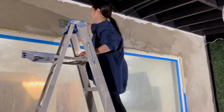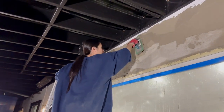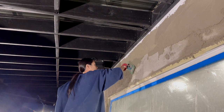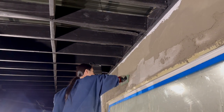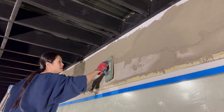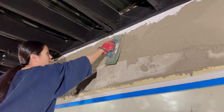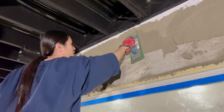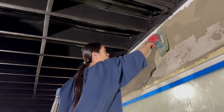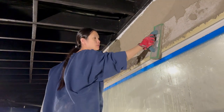So Akosko's taking a break. His assistant — slash the real mastermind — is stepping in for a moment. Feathering it so that he'll blend out and then also create texture so it'll look like it matches the existing walls. You just have to give the wall a massage, basically. We have to get all up in here because remember when it wasn't a straight cut — it was like a jagged edge — so we have to make sure that's nice and secure. Hopefully it won't break on us in the future.